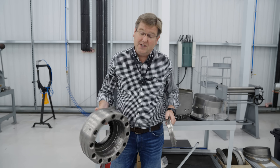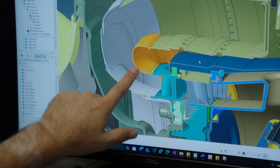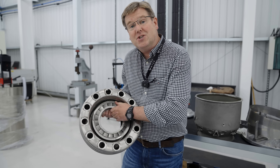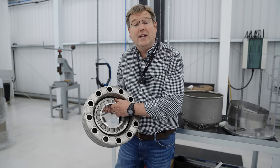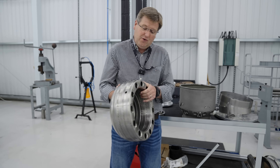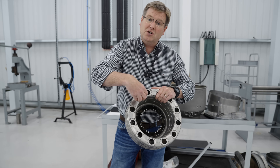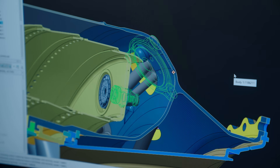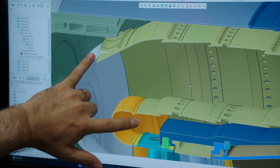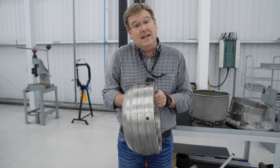One of the most important features is we've now integrated the HP turbine nozzle guide vane as an integrated welded part of the combustor, to make sure that connection is aerodynamically smooth and structurally very strong and robust. We've also improved the way that we can fit and seal the fuel injection nozzles as they come through the combustor casing into the back of the annular combustor, and we've improved the overall thermomechanical design